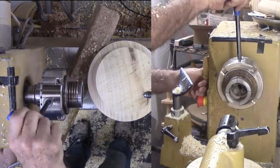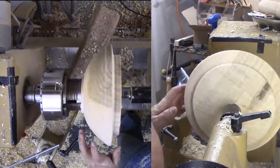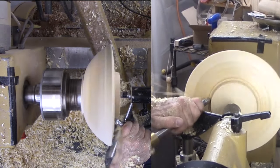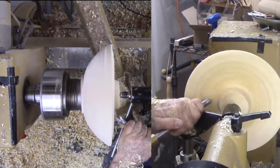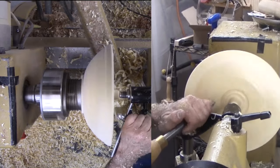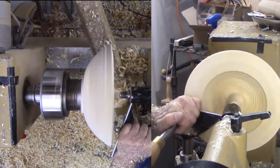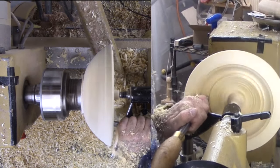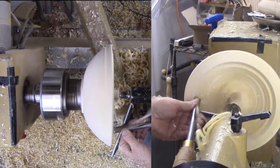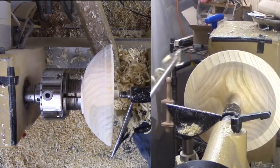Now swap the pin faceplate for a chuck and reverse the bowl. I'll keep the live center for safety while I take the initial heavy cuts. After flattening the top, I can hog out some of the interior. These cuts are from the center going deep and cutting out — I can remove a lot of wood. But this is risky; I have to make sure that the wing of the gouge does not catch at the outer wall. Then switch to a more precise cut from the rim to the center. Since this will be left rough, I do not need a lot of precision, but I still leave the post at the live center. Finally, take out the post followed by a couple more cuts.